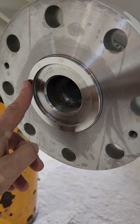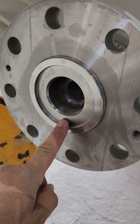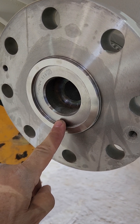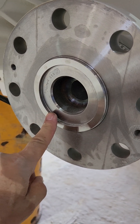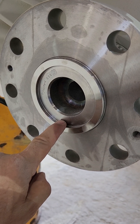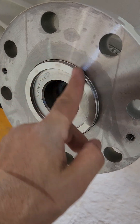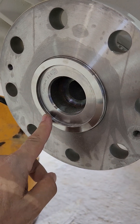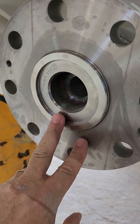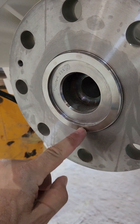It's very critical that these two match. The shaft coupling and the transmission coupling have that male-female engagement, and it must be correct. It has to be centered so that there's no offset in the shaft when it's spinning, and they have to essentially be the same — a slightly interference fit where they fit snugly. And of course this surface must be pristine.